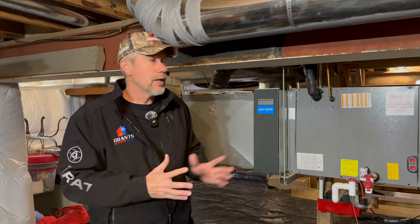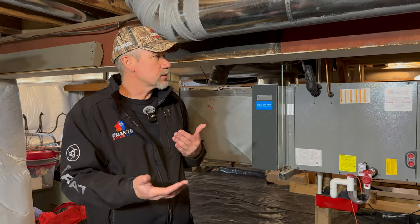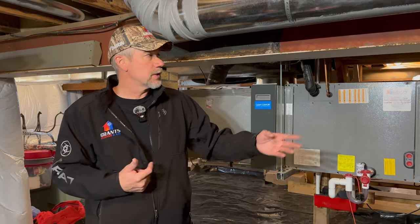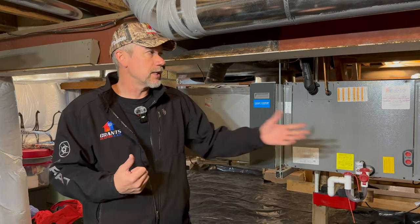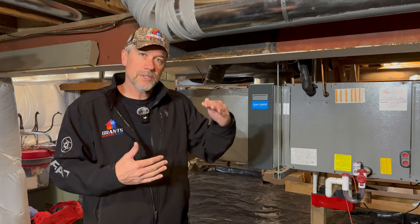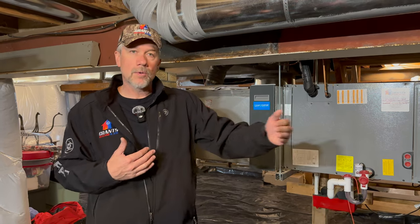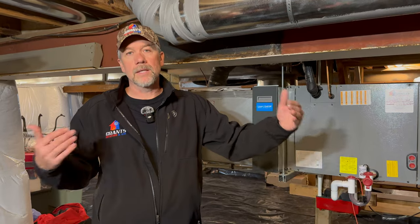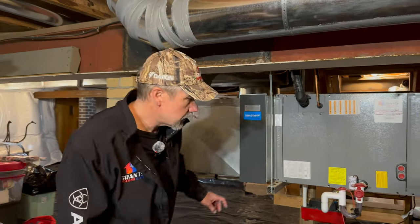It's really neat to take a home that had no ductwork at all and make it super comfortable — with humidification, air cleaning, and comfortable heat pump heating. A traditional gas furnace just cycles on and off, whereas a heat pump system with an inverter compressor will modulate down and back up, providing long run times that keep the home comfortable without using a lot of power or costing a lot of money.